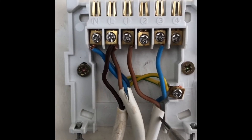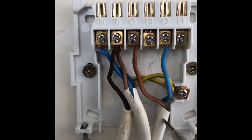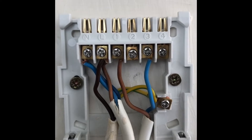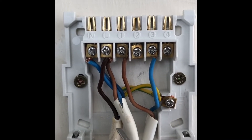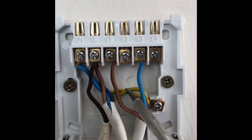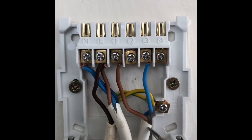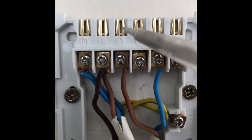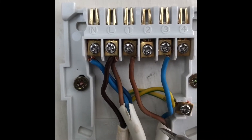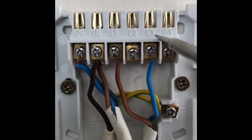This wire on the other hand is our connection wire — this is what we're going to connect into the boiler to make sure the Hive works. You've just got a live brown and a neutral blue in this situation, and the earth. We're looking at two communication cables to go back to the boiler. Number one on the Hive is always going to be the common, so we're going to take the brown wire as the common and use the blue wire as number three.